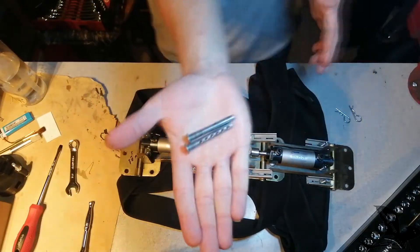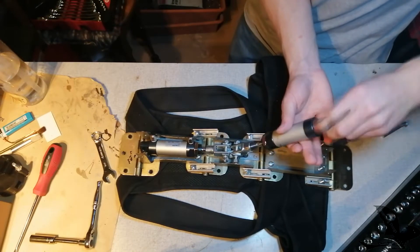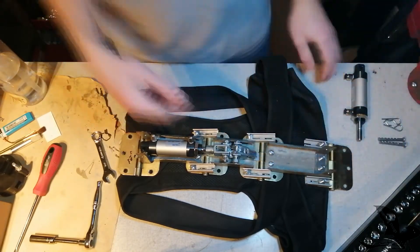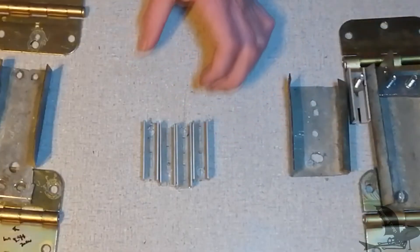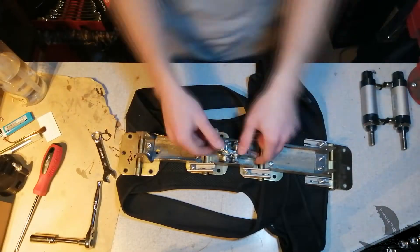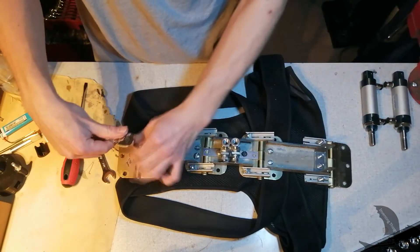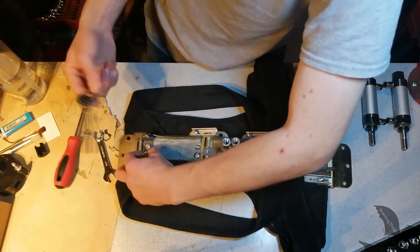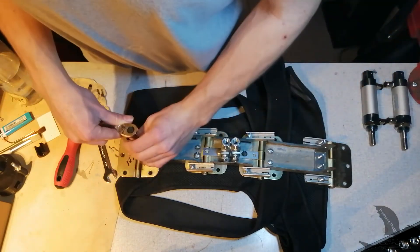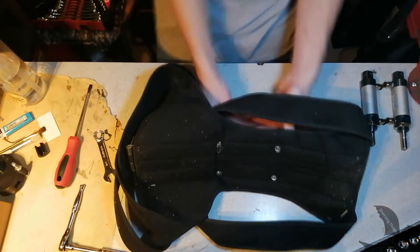Dismantling the spine in order to show how it was constructed in closer detail to the camera. These little pieces of metal are used to prevent the spine from going backwards — we need eight of these, and any metal should work; I'm using aluminum. The great thing about the design is you can implement a variety of different materials to replace the main structure. Materials like Kevlar and carbon fiber can be substitutes for metal.